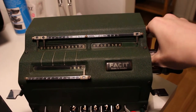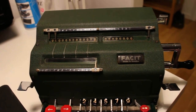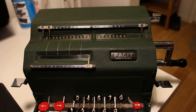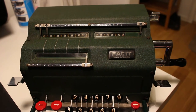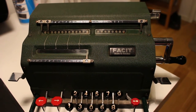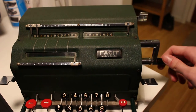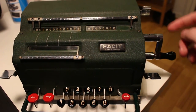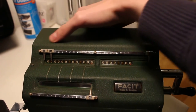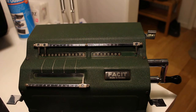Then I clear the machine. It's a very neat device with a very smooth action, due to the fact that internally the pinwheel rotor has every tooth that interacts with the accumulator register slightly stepped, so that only two pins will ever engage with cogs in the accumulator at the same time. This creates a smoother rotation action. This of course differs when doing a carry operation, since that requires engagement of the carry rotor, which is located at the back of the machine. At some point I will take the cover off and show it working, since it's fairly simple to remove and quite interesting to see in action.